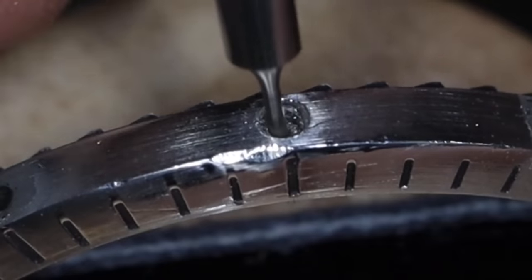Right, so some 9501 where the rocking bar meets the yoke spring. Some D5 on the setting lever. Some D5 on the post where the yoke will sit, and also in the center of the sliding pinion where the yoke will rest. Some 9501 where the yoke meets the yoke spring, and some where the yoke meets the setting lever.